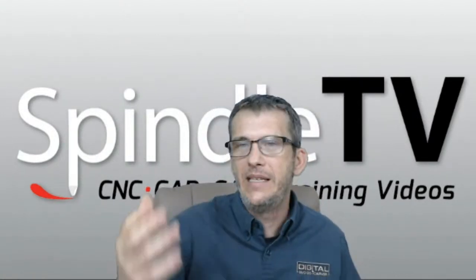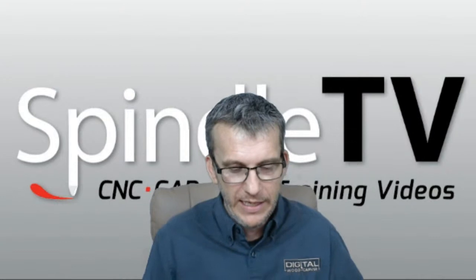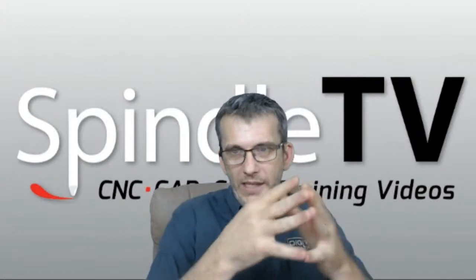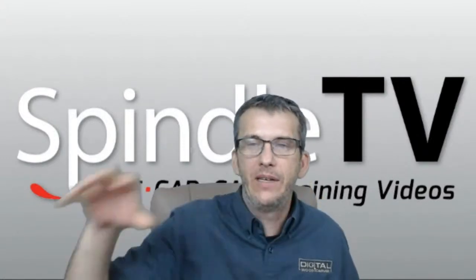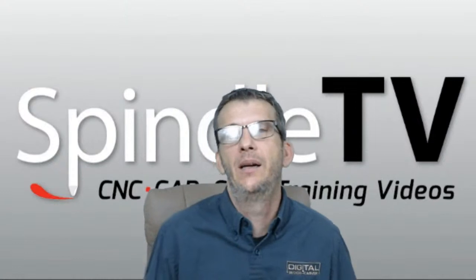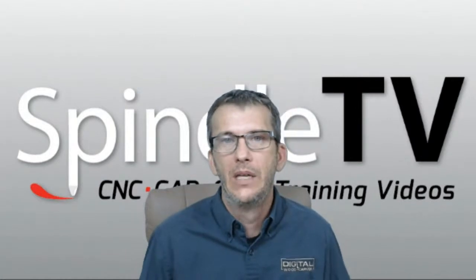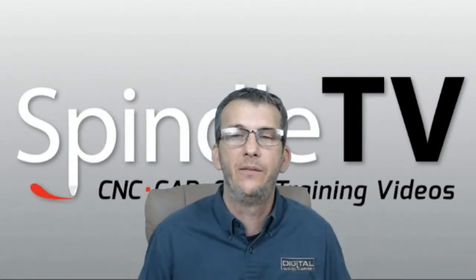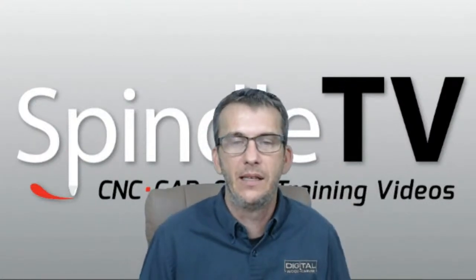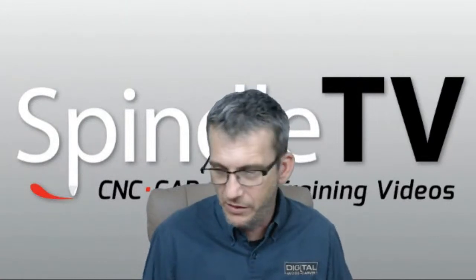Now, I'm going to be showing some of Garrett's video and comparing it to my results. But in those videos, once they process the images and get ready to take them over to laser engrave, he's using a small 4-watt laser engraver, but he's using LightBurn, the program LightBurn. Well, we're using Vectric, right? So I wanted to talk about the process of bringing it into Vectric with the new Vectric 10.5 laser module, and some of the settings and adjustments that need to be made to create the toolpaths for the laser engraving, right?